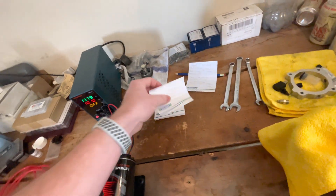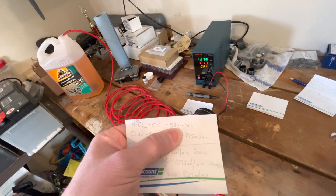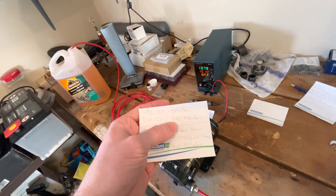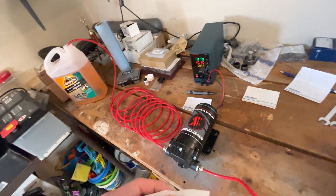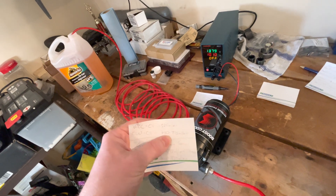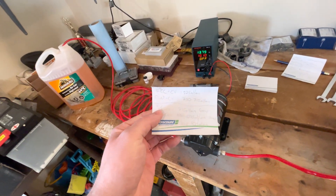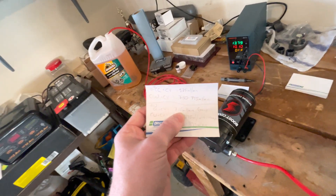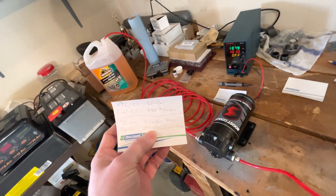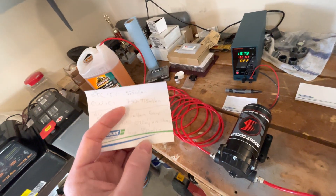For the number six nozzle: at the fully unwound minimum setting — that 6 amp range — you get 525 milliliters per minute. Maxed out at the 9.6 amp range, you get 750 to 775 milliliters per minute. For the number 12: minimum setting at 6 amps gives 775 milliliters per minute. Completely maxed out, it does 1050 to 1075 milliliters per minute. At the 7 amp range, supposedly 200 psi, you'd get around 825 milliliters per minute on the number 12.